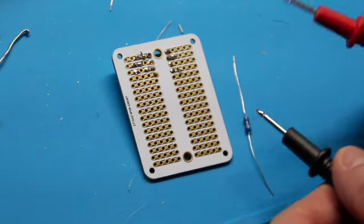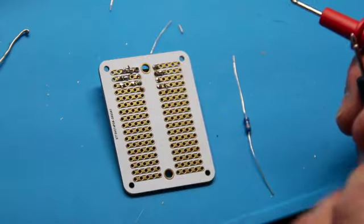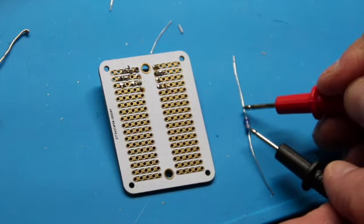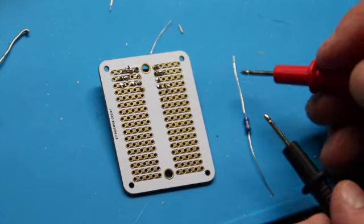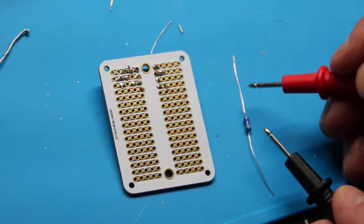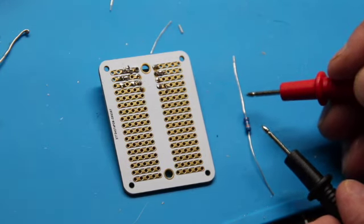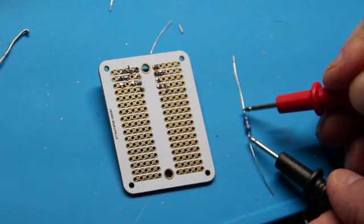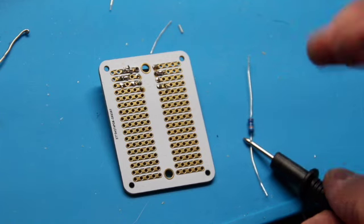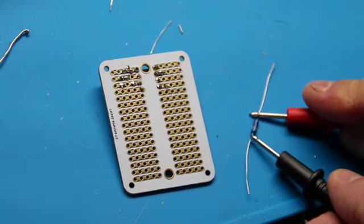I would tell you because I built this board before with a 470 ohm resistor on that first one that's supposed to be 470,000 ohm resistor, and my light just lit up and it wouldn't blink. And luckily that was on a breadboard, so I was able to eventually figure out where I'd gone wrong before having to solder something up. But the value of the resistor does, of course, make a huge difference.